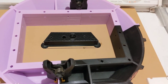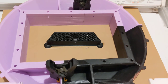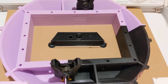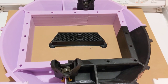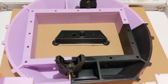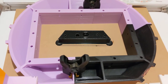I don't see anything wrong if I take the filament out and just turn the nozzle temperature up past the melt point of PETG. Filament comes out, but then when I try to load filament, it gets to a certain point, and it seems like it's pulling it all the way down into the nozzle, and a little bit comes out, it seems okay, and then I start to print, and after about 30 seconds, it stops extruding the filament.